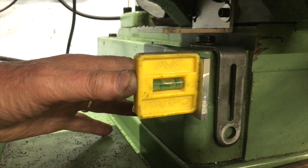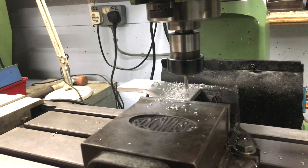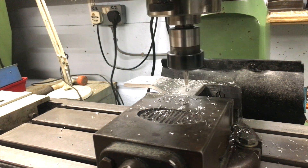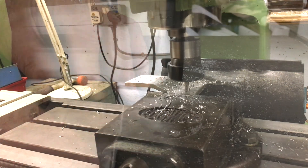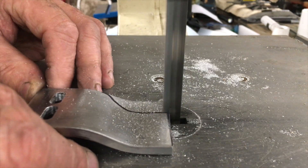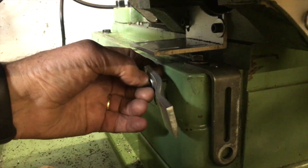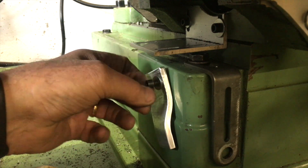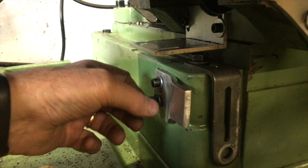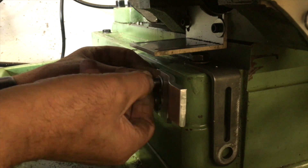But while doing it a casual observer might have thought I'd lost it. According to the spirit level it looked good enough to mark out and machine the slots, which wasn't easy as the material was a bit gummy. I also profiled a section of the bracket on the bandsaw, then finished dressing it on the belt sander. I mentioned earlier about an issue regarding the suds drain holes. I solved this issue by trapping a bit of brass shim as a deflector, trapped in place by a penny washer that holds the bracket in place.